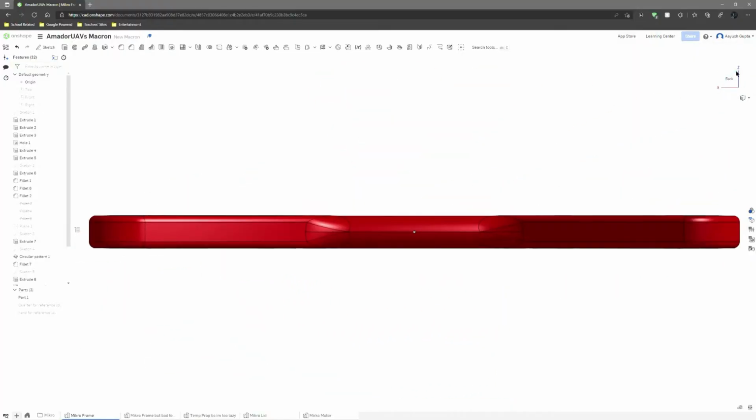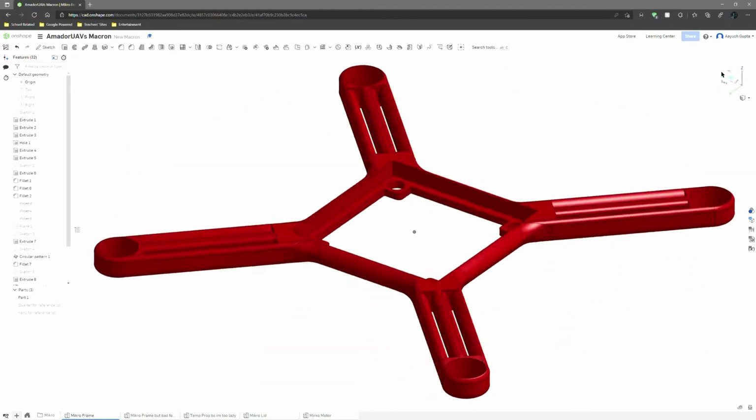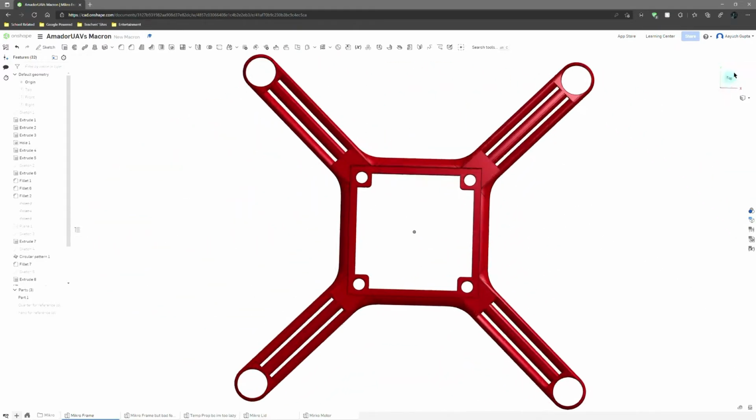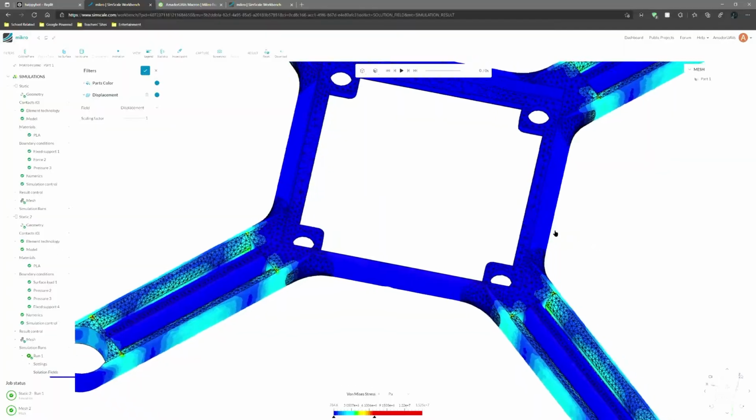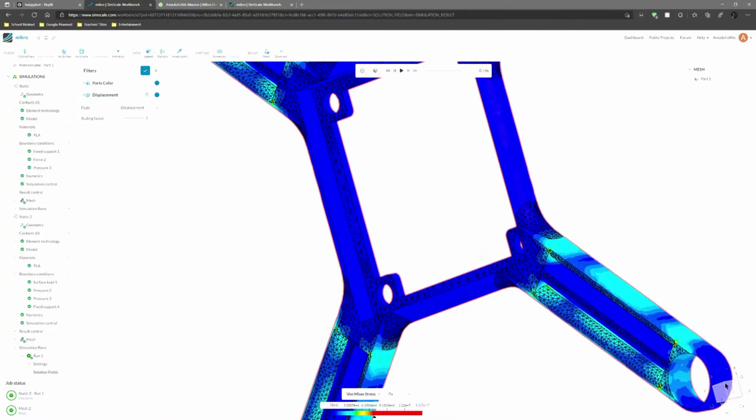Designing a custom frame was one of the various challenges we needed to solve in the design. Our frame needed to be as light as possible, while also being sturdy enough to survive the regular crash. Tasked with a nearly impossible weight limit of 10 grams, we made it work by using a regular X frame design, opting for a simple friction/glue fit for the motors. By integrating the flight controller PCB into the frame design as a shallow basket component, the PCB partially helps distribute the force on the drone, making it more resistant to crashes.